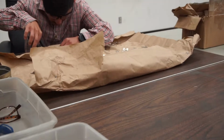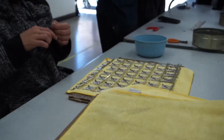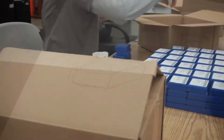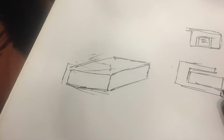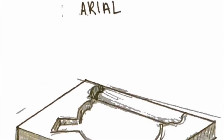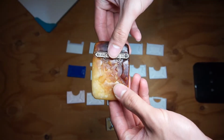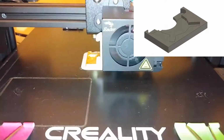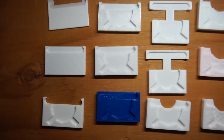After noting bottlenecks within the assembly process, we brainstormed and eventually settled on 3 prototypes: a metal alignment jig, an O-ring opener, and a label aligner. The metal alignment jig for Station 2 required many drafts and revisions as it involved small parts with tight tolerances. The original clay model had a bulky design and faulty alignment that made it difficult to use. Clay was replaced with 3D printed parts, which were then altered to fit more precisely.